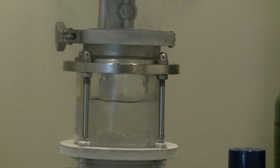Extractor. It has vacuum ports, it is ported for active and passive, has condensing coils in it, stainless steel column comes standard, the bottom's water jacketed. A few more upgrades: interchangeable column size, you'll be able to run 2 to 4 pounds, 4 to 6 pounds, and 6 to 12 pounds in that unit. Our 3-pound prototype that we're running right now recovers 90% of its solvent in 45 minutes, and that's not with all the upgrades that we're going to be including on the next side of Mr. Extractor.